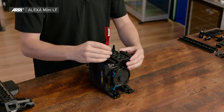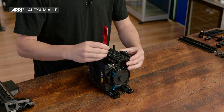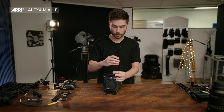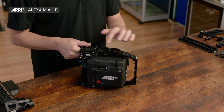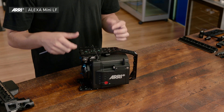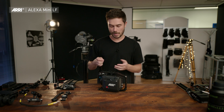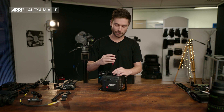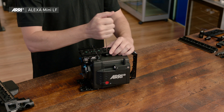There are four 3mm Allen key screw holes, and then two additional ones that lock the RAB-1 into the MAP-2. There's a little diagram which points in a weird direction — it says unlock is in a clockwise fashion, which would be wrong normally. But because these screws are drawing from under the MAP-2 up into it, it's actually lefty-tighty, righty-loosey. So we can draw these up through the bottom of the MAP-2 and lock them off, giving us a really rigid cage setup which is usable in its barest form.